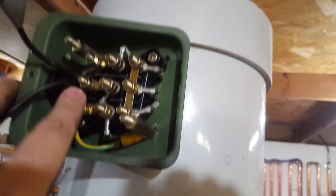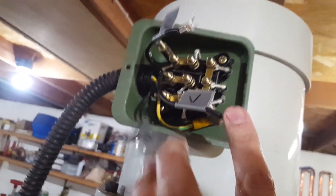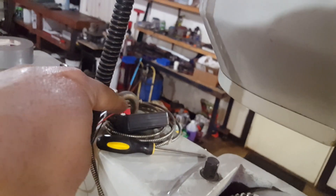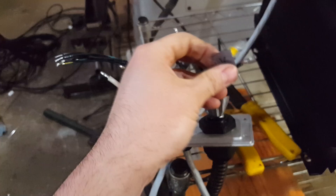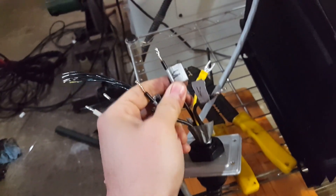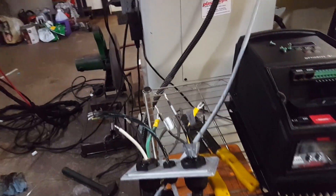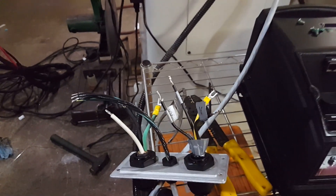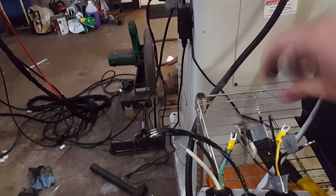I need to figure out which wires I'm going to hook to U, V, and W on the VFD. I've already determined that and put tape on the wires to keep track, using a continuity tester to check from one end to the other. I also put tape on the far end so I can keep track. Worst case, if I get one flipped it won't hurt anything — it'll just make everything go backwards — but I want to start out correct.